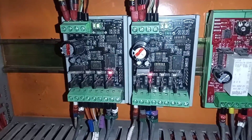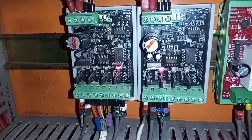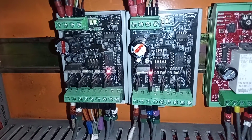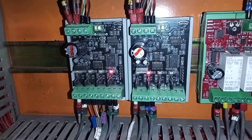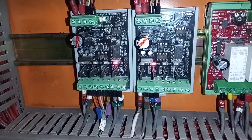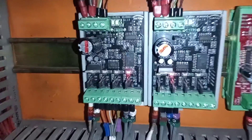The purpose of these I/O DIM units is that they are intended to be used with BMS controllers to expand their input capacity by multiplexing four or six digital signals — 24 VAC/DC inputs — into a single analog controller unit.